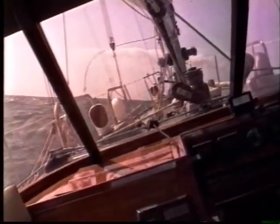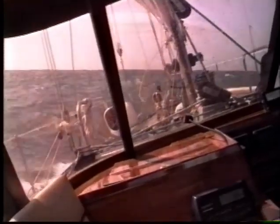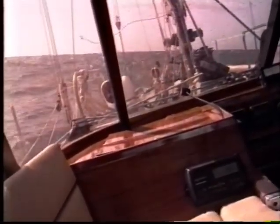We seem to do a lot of passaging with the wind right on the nose. When the breeze gets up over 17 knots, if we're making a long trip, we'll motor sail with a reefed main. Keeping the wind at about 15 degrees just fills the main and provides a surprising amount of drive. With this approach, we can handle up to 35 or 40 knots on the nose and still make good progress. Even with big seas like these, Sundeer keeps us reasonably comfortable.